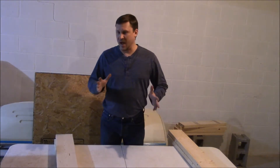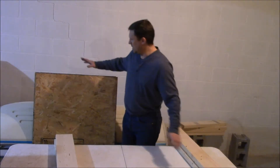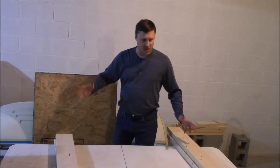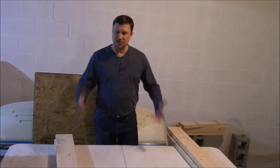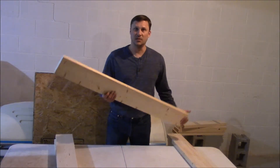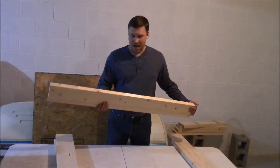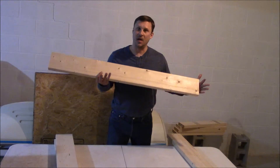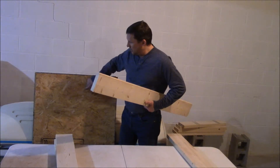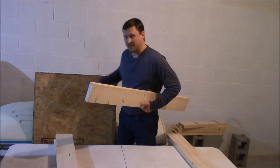It's a box, and you make it out of simple two by sixes and a sheet of plywood — this is actually OSB board. I got this stuff at Lowe's, got the measurements I needed, and just had them cut it for me. I ended up getting a total of five two by sixes. They were two by six by eights, and I had them cut three of them in half. I had the plywood cut in three equal sections, which is 32 inches across, four feet wide.